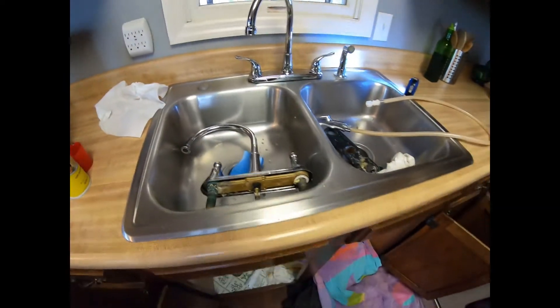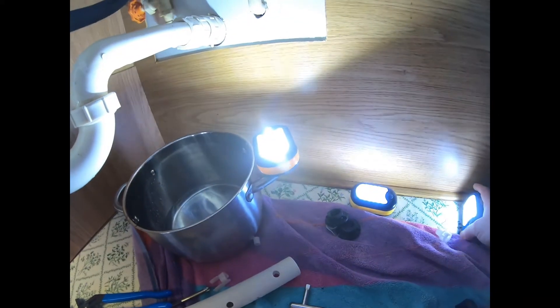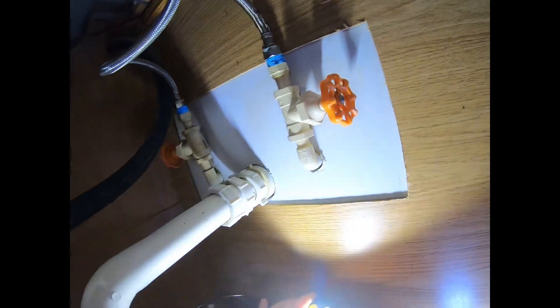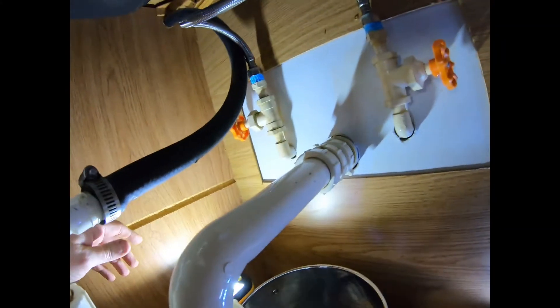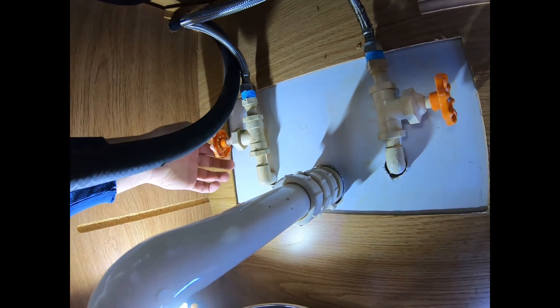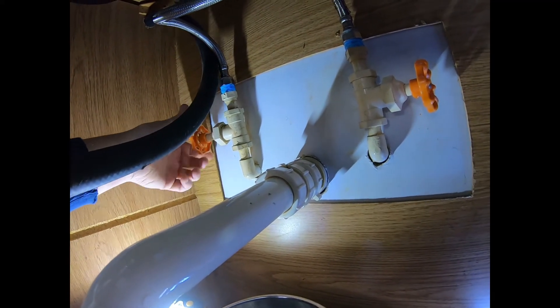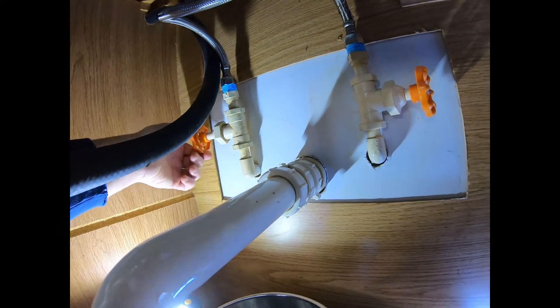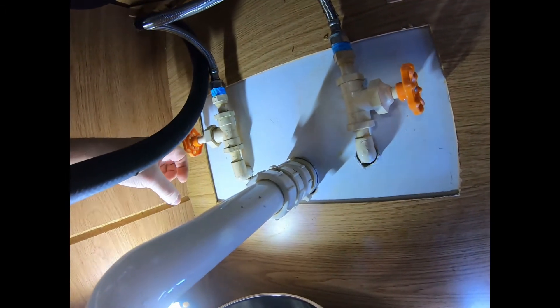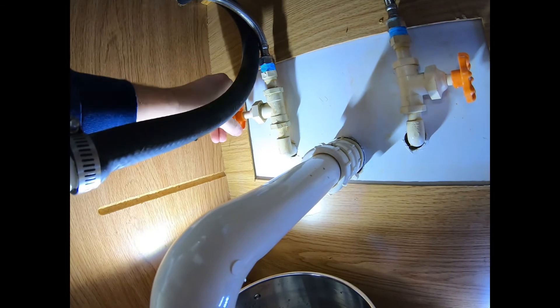This is all done up here. We're going to turn the water on and look for leaks. Here's what we're going to do — turn on the hot water first. I'll turn this all the way out counterclockwise. It's not uncommon for these valves to sometimes drip a little here. Sometimes you tighten that packing nut — this is a packing nut. You don't want to mess with that if you don't have to, especially with plastic ones since you can break the whole fitting.